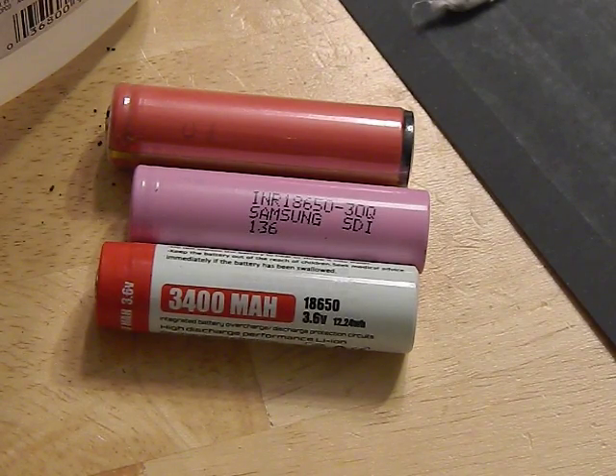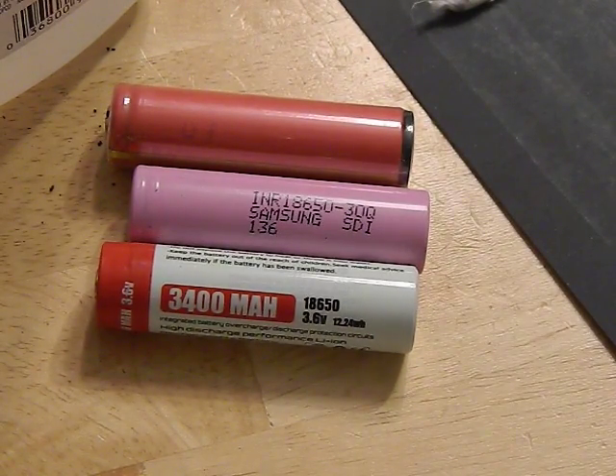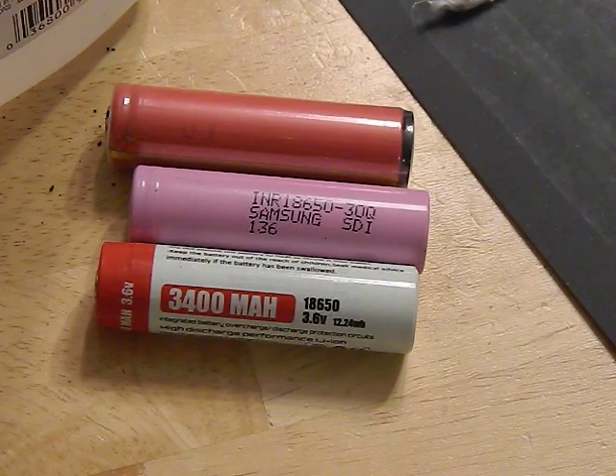Protection is not fail-proof — protected batteries have blown up. It does give you much better safety, but it's not 100%. Part of this comes down to battery chemistry. INR and ICR style batteries, like the Samsung here, are a pretty unstable group and the most common to blow up. Modern IMR batteries have a much safer chemistry and are far less likely to fail, so you often won't see protection on IMR batteries — only on INRs, ICRs, and others.